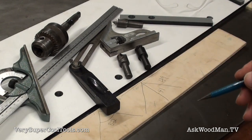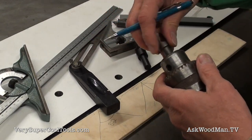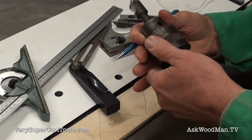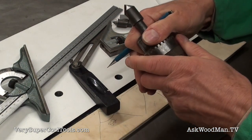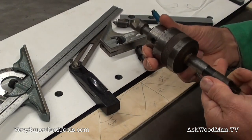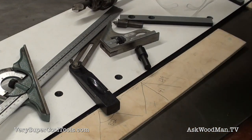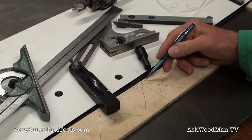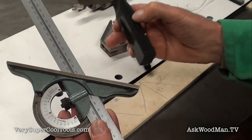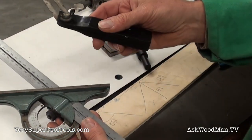We're going to set that fence on our bench grinder, and we're going to put the countersink in this Jacobs Chuck — one that fits the number-two Morse taper in my lathe, so I just keep an extra one for all kinds of things. This flat reference surface is going to let us spin the countersink and get it really nicely touched up and sharpened without removing too much material. We'll set our little fence at 49 degrees using my protractor head and a sliding T-bevel.